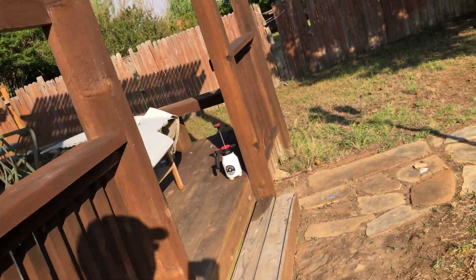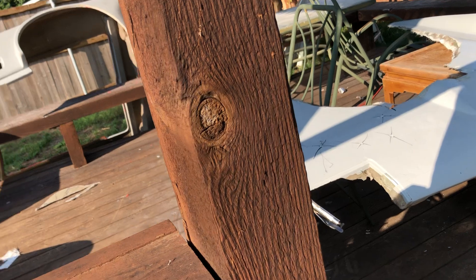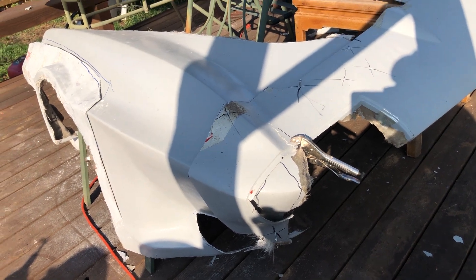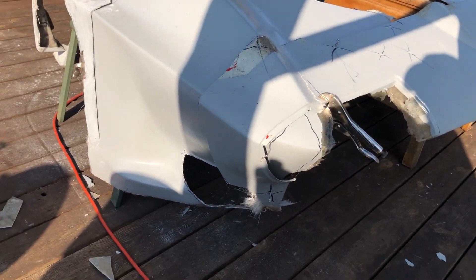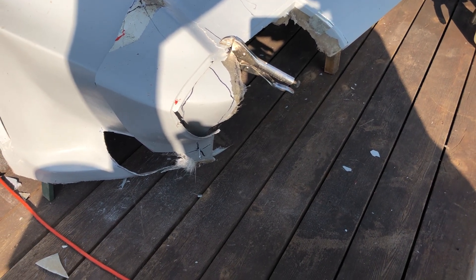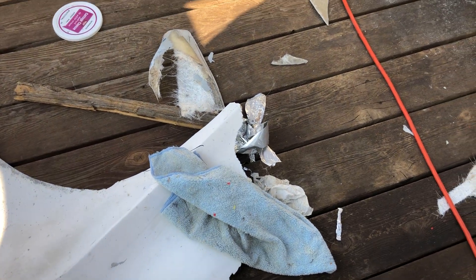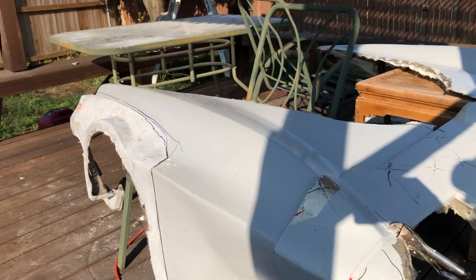Here's what I've been doing: I took the C8-to-C2 body parts and made a mold off of them, then actually made the body panels. Here's a passenger side fender and the driver side fender. They're not the same because the shop cut off the front end and damaged it. The hole on the bottom is where the C2 turn signal went — there's no such turn signal on the Grand Sport, so I cut it out.